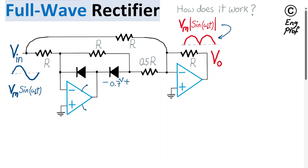Let's assume op-amps are properly biased — whether it's plus/minus 5V or plus/minus 10V supply connected for both op-amp 1 and op-amp 2. The output of op-amp 2 is constantly connected to the inverting input terminal, so there is always active negative feedback present for op-amp 2. Therefore, as long as it's biased properly, it will be in negative feedback and operating in the linear region.